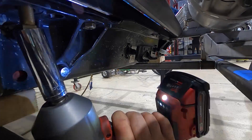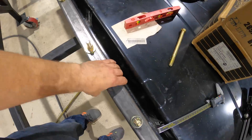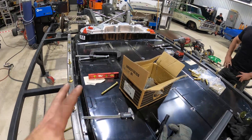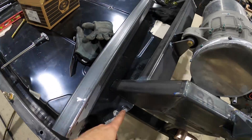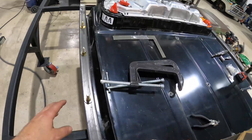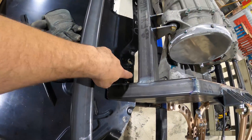We're making quick work of the side rails. Donnie drilled all the holes on our drill press and we have half-inch bolts through-bolting through the side of the battery at the factory points to hold the frame rails in place. We're at 17 inches front and rear on both sides — battery and chassis are squared up. Donnie is now making mounts from the face to the corner of this frame rail, gusseting down inside to create a strong triangle at the front. In the back we'll use a four by two — nice and tall, stronger, and more beefy.